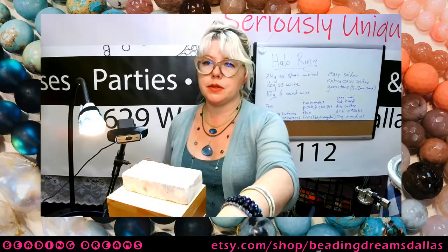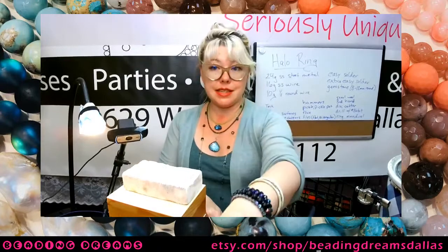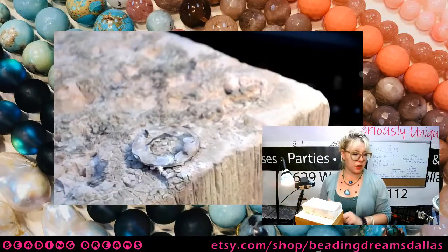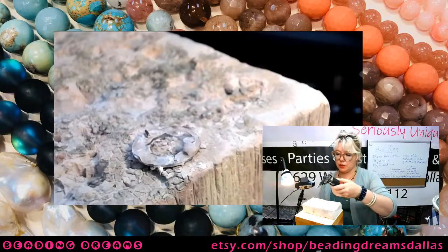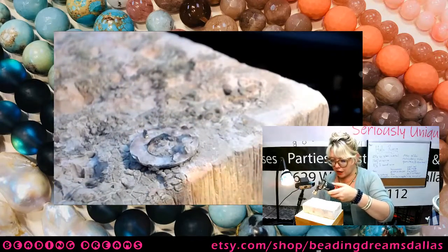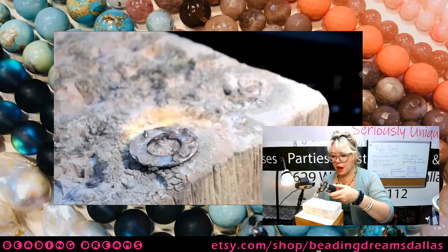So now what I'm going to do is, I've taken my extra easy solder, which is a lower melting point solder than my easy solder that I used to solder my prongs in, and I've placed two pieces, one directly opposite each other on my backside still of my setting. I'm going to go ahead and sweat those onto my setting. So what that means is I'm going to burn off all the flux and I'm going to melt the solder. So I'm going to heat until the solder flattens out and then I'm going to stop.